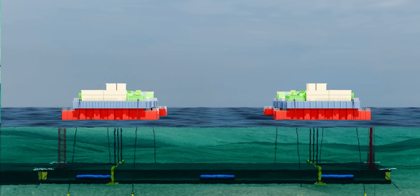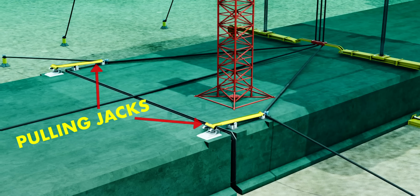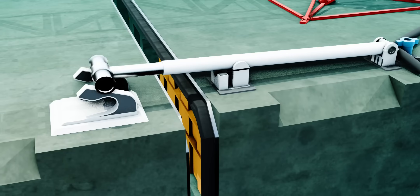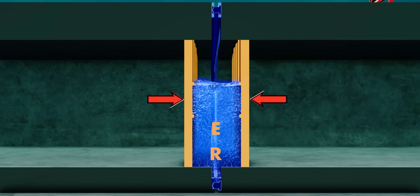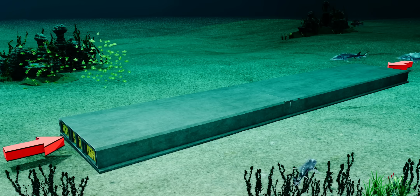Observe very carefully. Very soon, a water chamber is going to form between them. First, pulling jacks are installed between the new and the previous element. An external positioning system slightly lifts the new tunnel element. The pulling jacks are then activated and the elements close. Now you can see that some water is trapped between the two elements, forming a water cavity. Similar to the experiment, by simply pumping out the water, the negative pressure inside the cavity will automatically force the elements to bond more firmly.